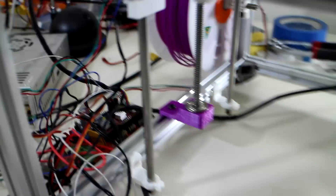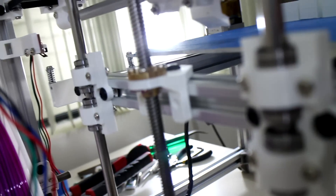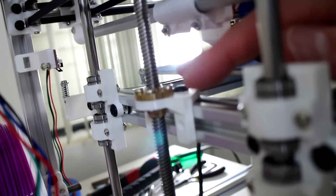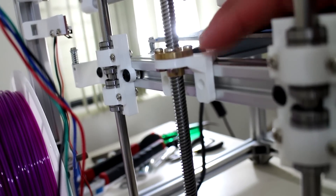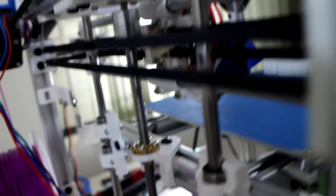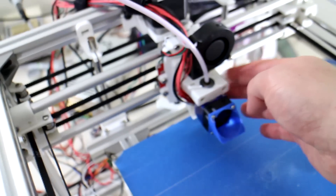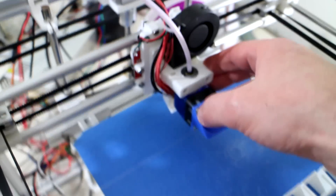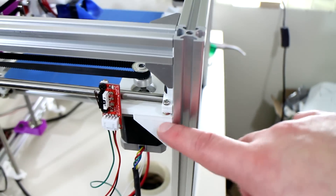To make matters worse, looking at the nut holder at the back, the whole bed is being suspended by just the button head screw at the top — I've run out of T-slot nuts, so I haven't populated the two mounting points at the back. So I'll be printing quite slow and conservatively, at least initially. Especially since the plastic parts I have are PLA printed at only 15% infill with two perimeters — basically hollow.